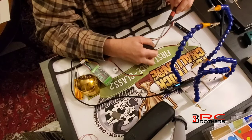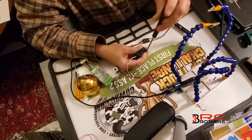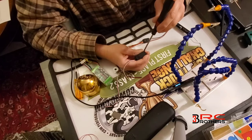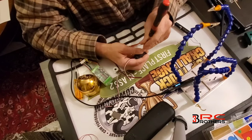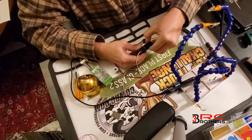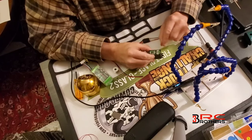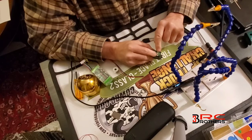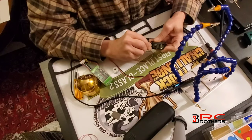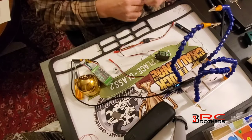Number one is undo the screws in the back. To use the Winch Master, we're gonna have to take the circuit board out of this, which is actually pretty easy to do. That's what this one looks like inside — there's the circuit board, and then there's the motor and your two wires, solder points that attach to the motor. This is all fixed to the motor, so what we're gonna do is get that circuit board out of there.